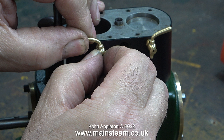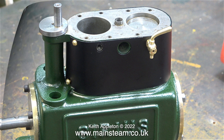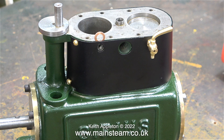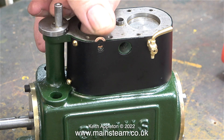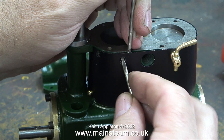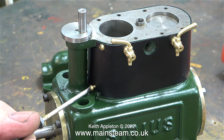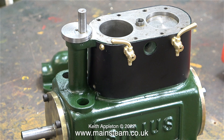To get the second drain cock in the right position it needs a shim washer, but I didn't want to fit one on the outside. Then I had a brainwave — I could fit the shim washer between the cladding and the cylinder block. I slackened off the 7BA bolt, used a screwdriver and scriber to carefully position the shim washer without scratching the black paint. Thankfully it worked, and you can't see the shim washer. The 7BA brass bolt was a bit long, so I shortened it using my 1-inch belt sander and refitted it to hold the cladding in place.